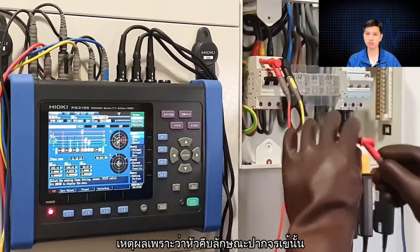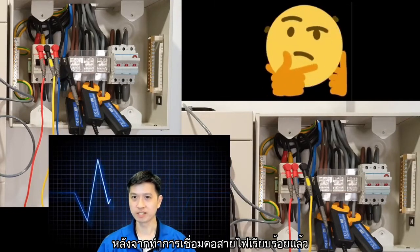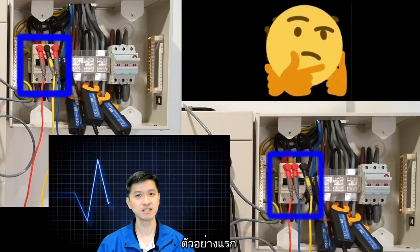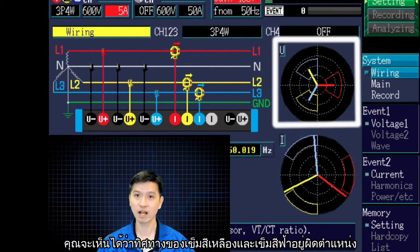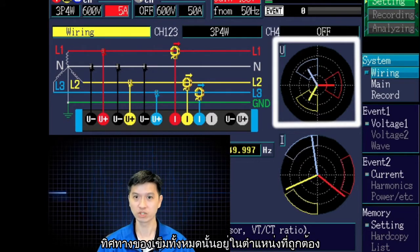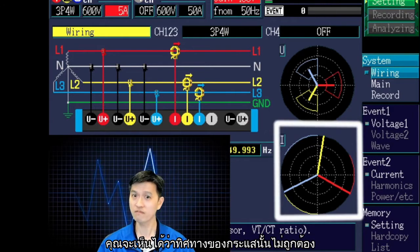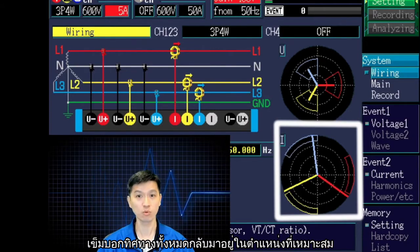The reason is because crocodile clips may not fit securely on the cable inside the circuit breaker terminals. After the connection process is completed, how do we know whether the connection is in order? One of the features that I like very much is the vector diagram for both the voltage and current. In the first example, if we deliberately swap L2 and L3, you are able to assess that the yellow needle and the blue needles are incorrect. After correcting the connection, the needles in the vectors are all showing the correct positioning. Likewise, for the current vectors, if the current clamp is in the wrong position for both the L2 and L3, you will see this wrong vector as shown. After correcting the connection, all the color needles are in the appropriate placement.